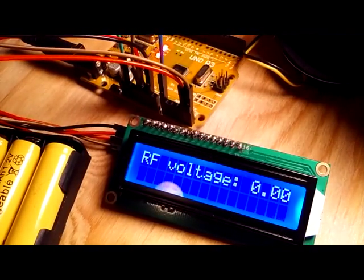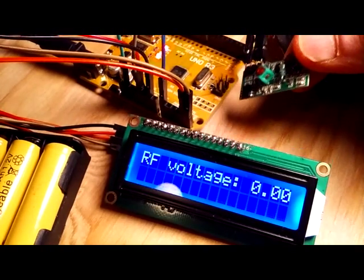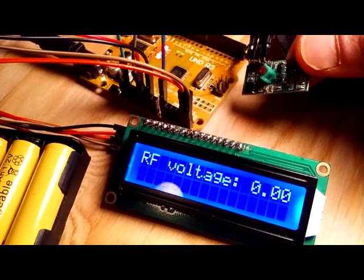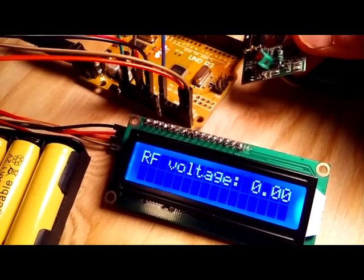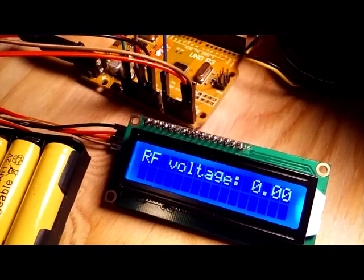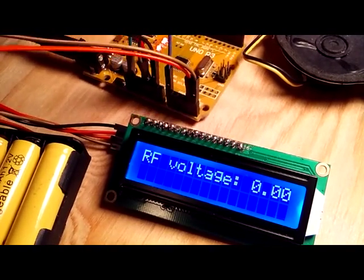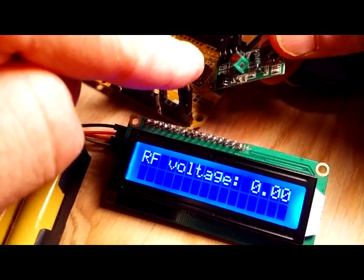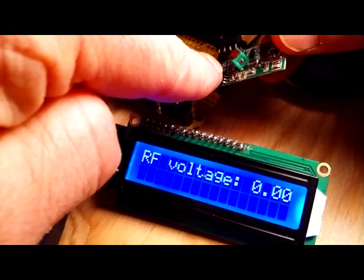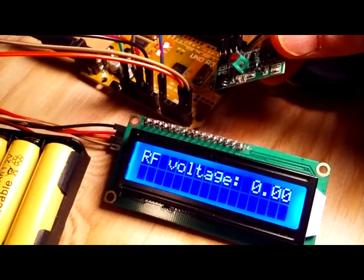However, I've only got one development board, my Uno R3 right here. So what I've done is I'm just checking out the value obtained on the data on this receiver on the 315 to 433 megahertz receiver, and I've got this going into not a digital pin, because we're not picking up any digital signal from the transmitter.